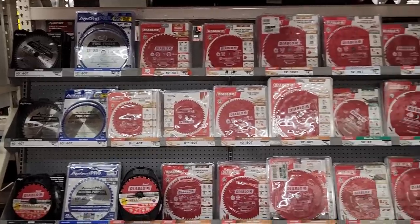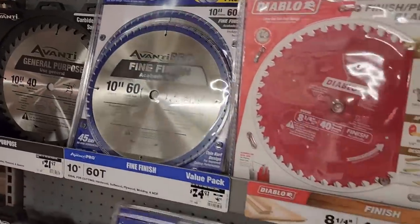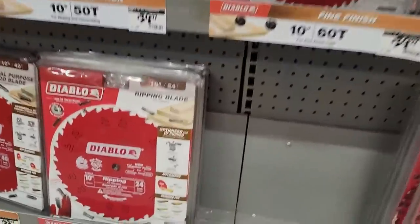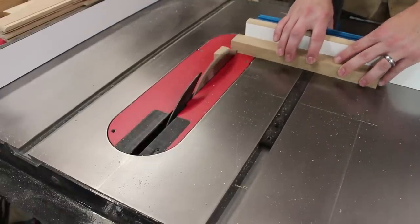The first thing you need to do is make sure you have the right blade on your saw. When you're cutting across the grain, more teeth is usually better. Woodworking blades found in stores have a range of tooth counts, usually anywhere from about 25 teeth up to 80 teeth. On a table saw when you're cutting with the grain, fewer teeth is better because you don't usually get tear out cutting with the grain and you're taking out a lot of material. If your tooth count is really high when cutting with the grain it will usually burn the wood. When cutting across the grain, however, higher tooth count is better.